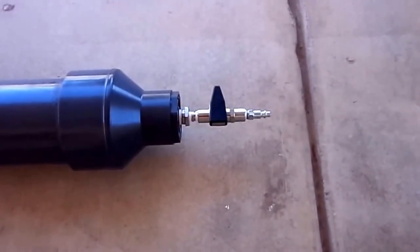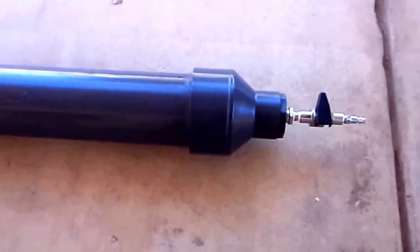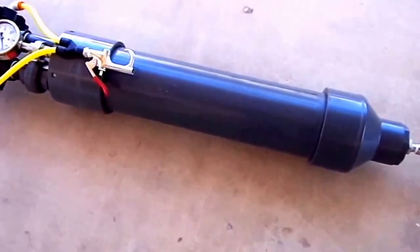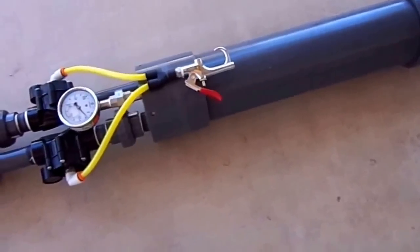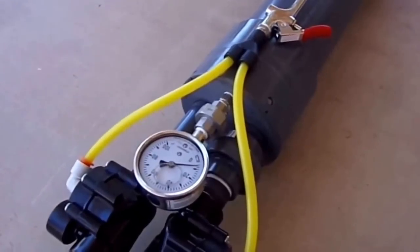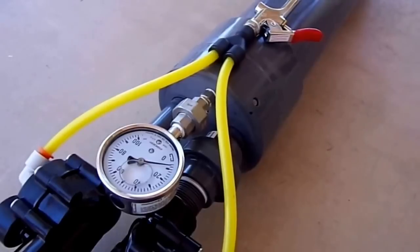There's a quarter inch turn ball valve to pressurize the tank. Shut it off when you get the tank to the desired pressure. The tank itself is 4 inch schedule 80 PVC, about 20 inches long before the fittings got glued on. On the other end there is a 4 inch coupling, and inside that coupling there is a somewhat custom machined PVC insert that allows you to get two 1 inch pipes side by side and a pressure gauge out of that 4 inch coupling.